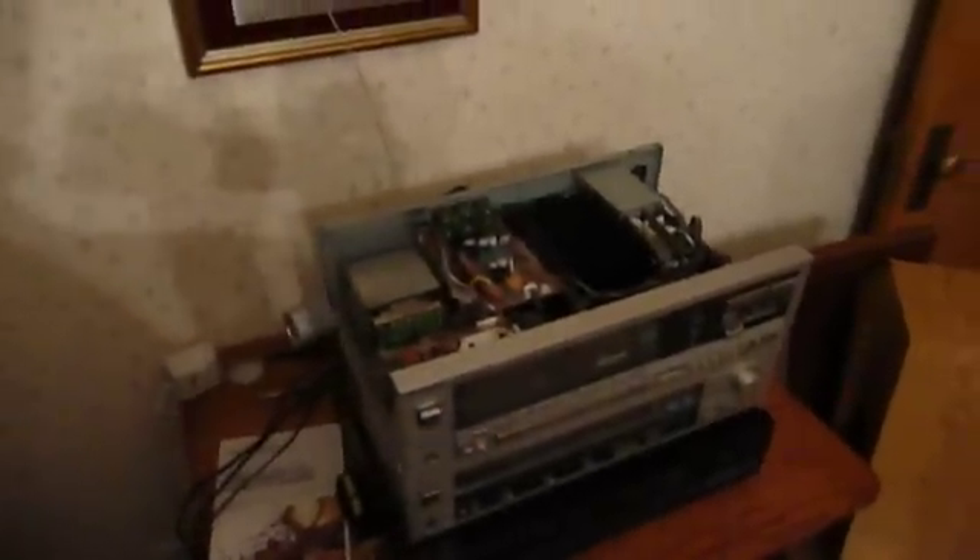It wouldn't fit the board precisely, so I had to come up with a bit of an interesting fix here — this isn't something I'd do on a professional basis or for anyone else, but since this is just my personally owned piece of equipment, I made a flying repair. If you look down in there on the board, you can see where the relay goes. I ran some Radio Shack 24-gauge speaker wire up here — mainly because I wasn't very impressed with it as speaker wire — but it worked fine as jumpering wire off the soldering points on the board where the old relay was, up to the new relay, which is kind of mounted in the air, although I will be zip-tying it down to something.